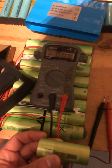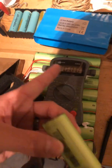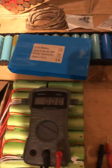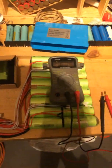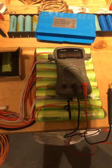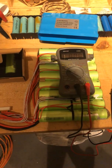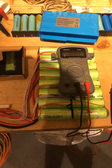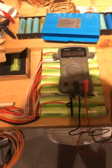I'm going to replace this and try to match up the 3.24-3.25 volts I've got on all the others. It'll obviously have a little more capacity than the others, but that should be okay with the balancer. I'll drain it down to near zero and then charge all the way back up and let it sit for a couple of days. Once that's done it should be balanced with the rest of them and the pack should adjust accordingly with the BMS.